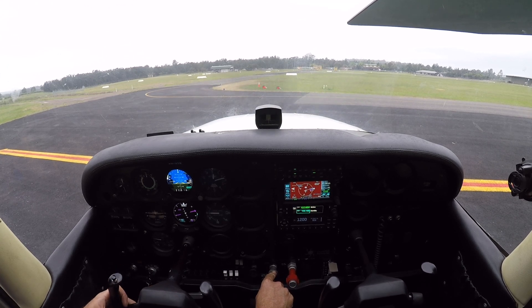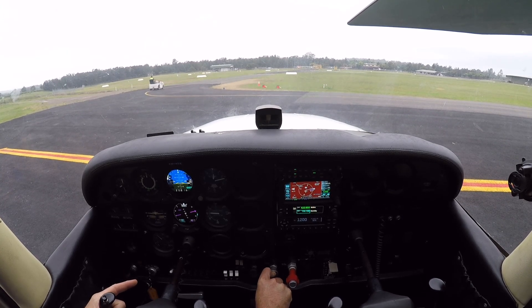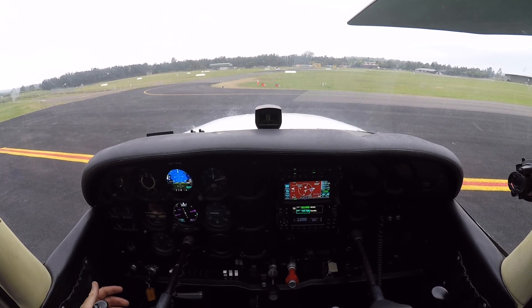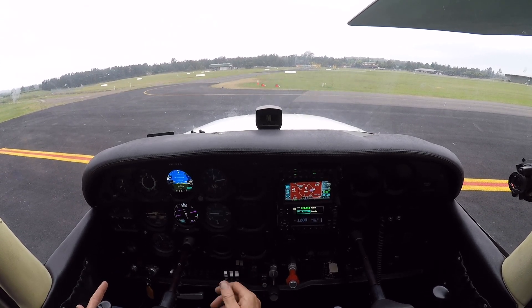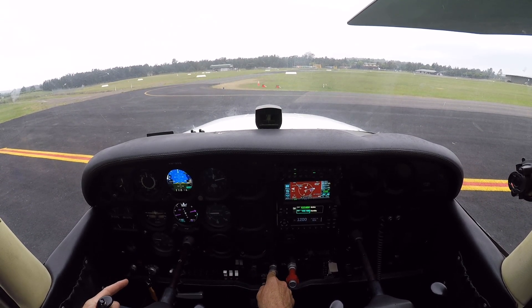Oil temp is coming up into the green so we will do our run-up. We'll just wait until the tug goes past so that the aeroplane doesn't leap forward. Covering the brakes, T's and P's still in the green. We'll bring this one up to 1700 RPM — and I always like to take the weight off the nose wheel as we do, because otherwise with the brakes on it's trying to pull forward, and we don't want to hit the prop if we really compress the nose wheel, or if we're on rocky surfaces picking up rocks. Mags — that one's good, about 100 RPM drop and sounds smooth. About 100 RPM drop and sounds smooth. Carb heat dropped, got a rise, manifold pressure is a positive output. T's and P's are in the green. This one doesn't have suction because it's all electric. We'll come back down and check our idle — about 650–700 RPM. We'll head back to 1000 RPM.